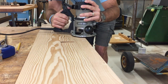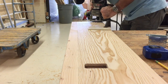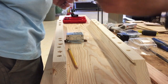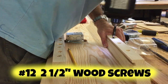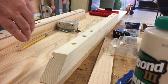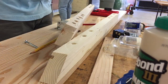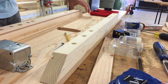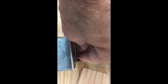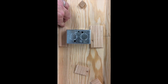I've changed out the router bit and now I'm putting a tapered edge on the top of the table. Now onto the rails — it's time to glue and screw them. I used a Forstner bit and cut down deep enough into the rails so my two and a half inch wood screws wouldn't poke through the top. I also drilled pilot holes before screwing in so I wouldn't split the wood. Because there was only a quarter inch left to the top, I couldn't screw in the outlet box directly, so I used some scrap wood pieces that I'll screw in later.